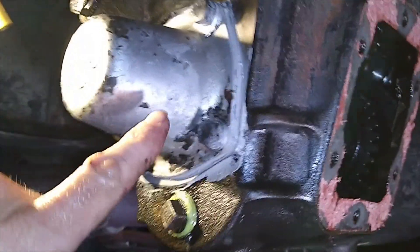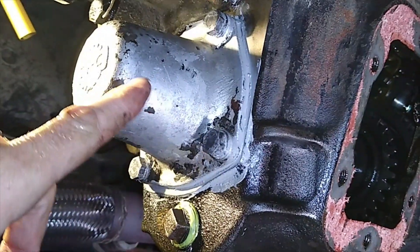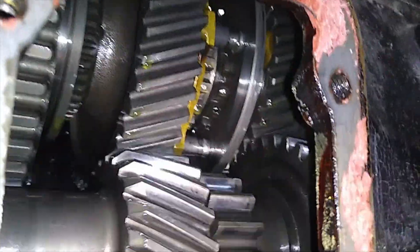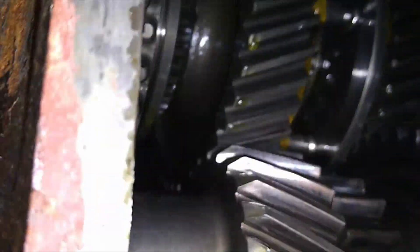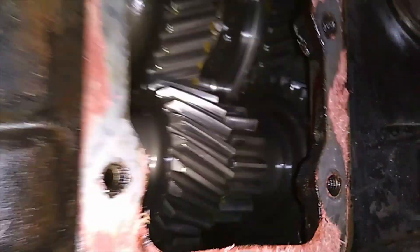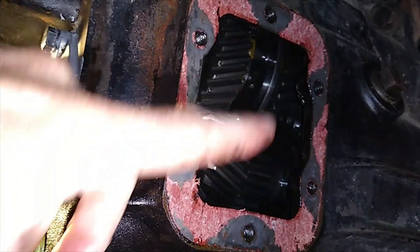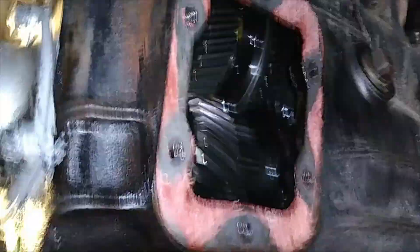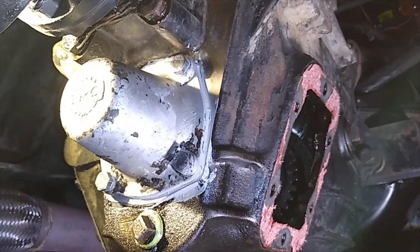Now we know what's behind this cover. One really obvious point: your gearbox needs to be empty of oil before you pull this off, because it's going to spew out everywhere. Just before we finish, I've got the side cover off - you can see what I'm pretty sure is the brass synchro in there. The overall gearbox appears to be in pretty good nick. They also do PTO oil pumps that hang off the side plates on either side. That's it - thanks for watching!